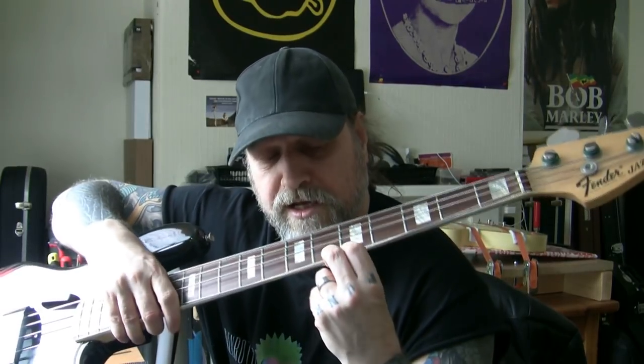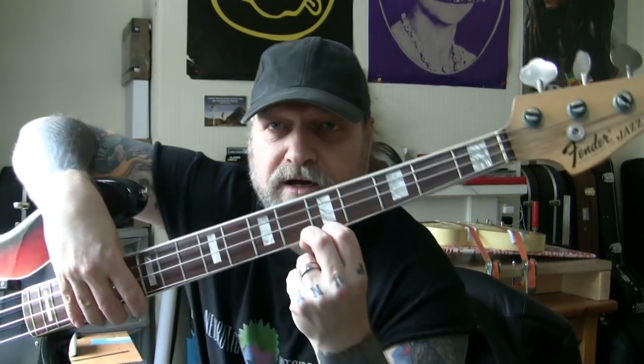You'll see it right there, just above my finger. If you want to zoom in and have a look — there's a ding in there. I was going to fill it with rosewood dust, super glue, sand it smooth. But instead I'm going to use a method I use now and again: I'm going to put a wet bandage over that fret — soak some 5mm thick felt in water and put it just over that fret. I'll let the water soak into the wood and it will spring the grain back out, bringing it back to level.